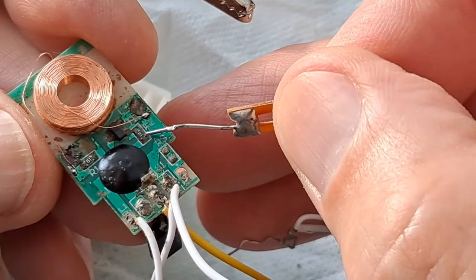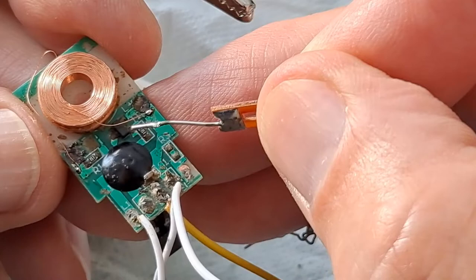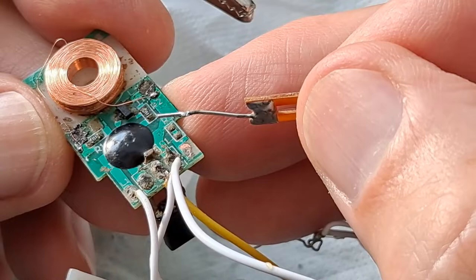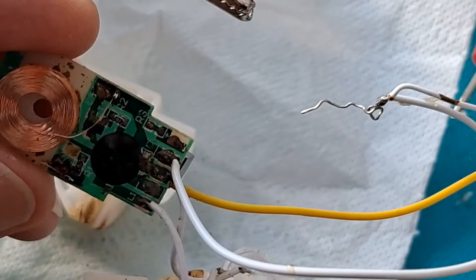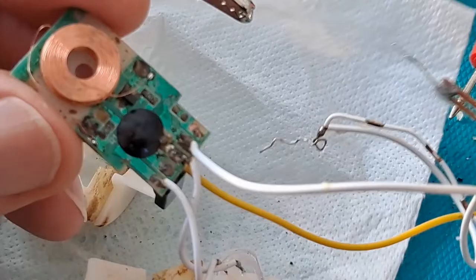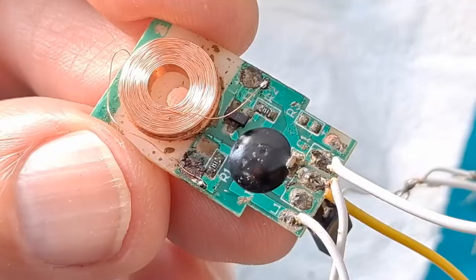The only external components: I've got a resistor there, resistor there, little transistor there, and I think that is a capacitor. And then the controller chip - the black blob that does the work. And that's an infrared sensor, that's an LED, and that's a coil.